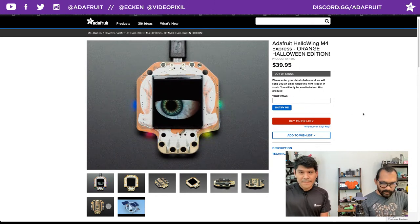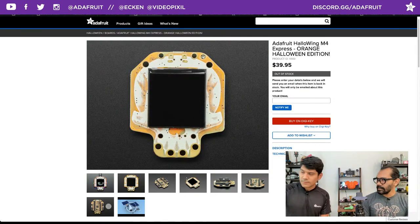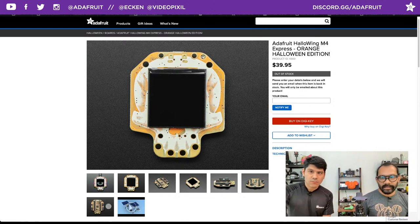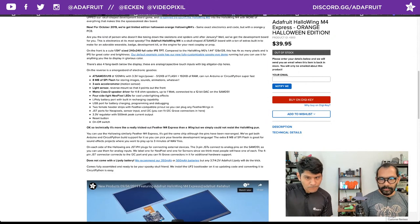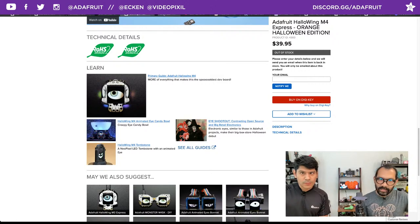Staying on the point of the touch pads on there, we have done experiments with mixing NinjaFlex and the conductive PLA filament that we have, and that works perfect. So you could break those touch pads out and have it be on the tips of the star and have it look left, right, or play sound effects. Ton of stuff that you can add to this base level project, which is a lot of the projects that we do. We want you to have a little starting point to jump off of and add more features and abilities.